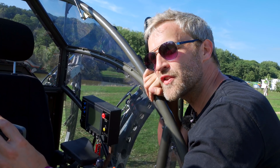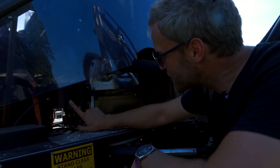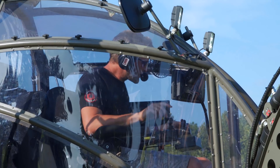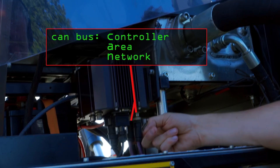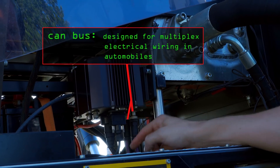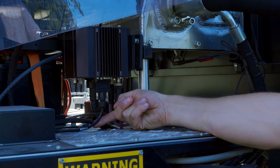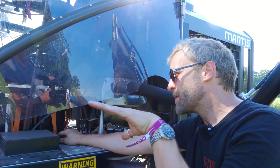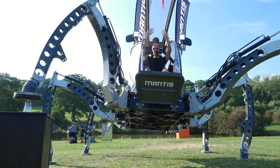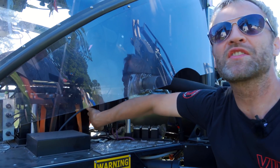The fancy dashboard is tethered via Ethernet down to the Hex engine control system around the side of the machine. Up underneath the driver's chair is the 486 stack in a PC104 modular format, in really nice robust cans. Two CAN buses come out the bottom, there's an Ethernet connection, power through the CAN bus connector, and a serial connector going to a little IMU measurement unit so the body attitude can be corrected according to gravity to level the machine off.